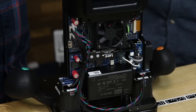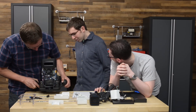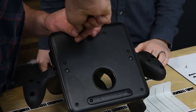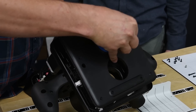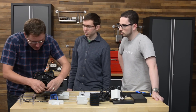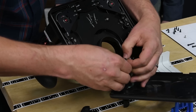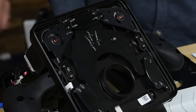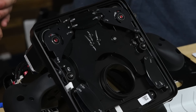Eventually we want to get the touch screen off. We have to decide if we want to go more towards the mechanical stuff next or the electrical stuff next — maybe taking the base off is a good next step. There's a flimsy wire down here — just two pins going to the touch-off weight sensor, and that's detecting when the device is lifted off the table. This is our XY mechanism and it's pretty non-traditional. Normally you see XY mechanisms as two axes perpendicular to each other stacked on top of one another.